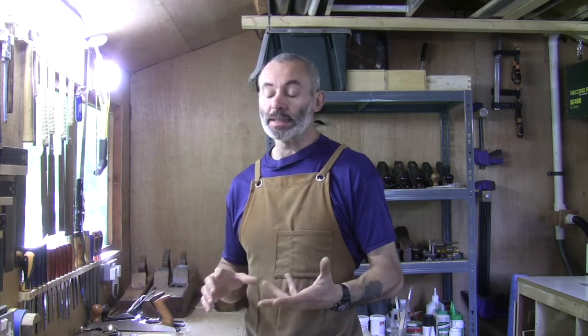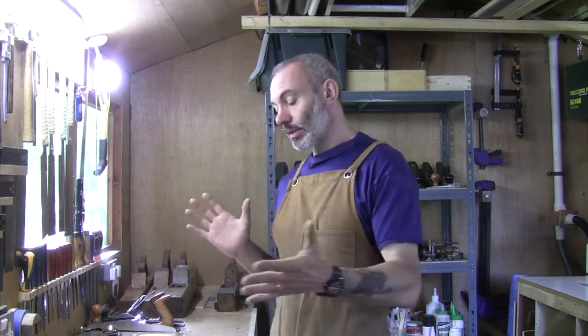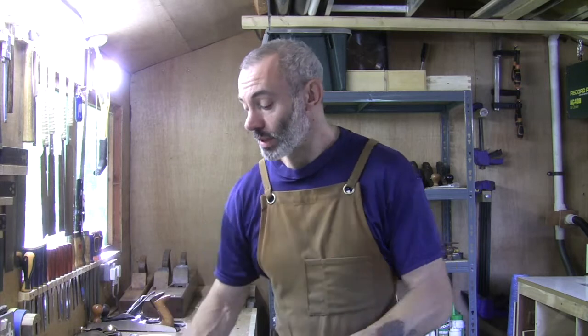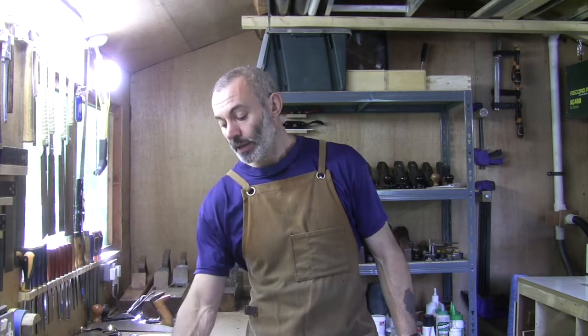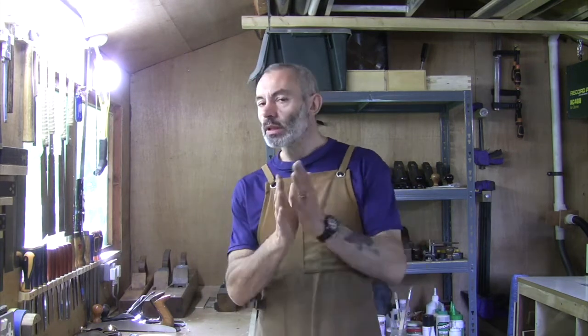Just about ready to glue up. What I've done is that I left the timber for a while after joining to just really let it settle. And in fact, I was right when I went back and looked at how flat it was and how square it was, but more importantly, how it was joined together between different boards. I got not a lot, but I got a worth of very, very fine shaving and tuning that I had to do out of it. Needless to say, this would have been nothing major, yet it wouldn't look as precise.